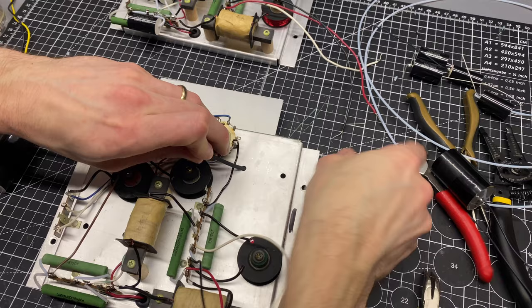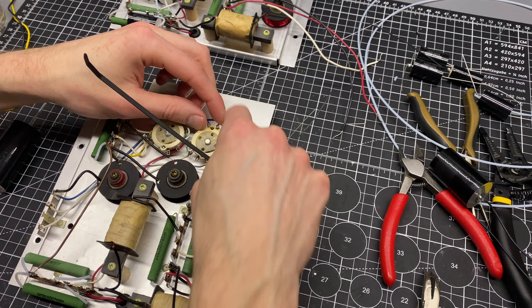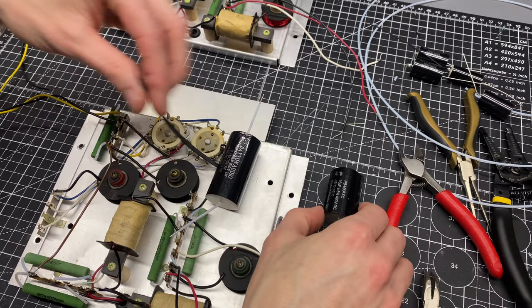So now I can line the end up underneath this hole, and then I can strap my capacitors in here. Now I have opened up this solder connection for the ground here and tilted it up out of the way so that I can get a little extra space for this guy. So I'm just going to dry fit these in. I'll get a loop started here.